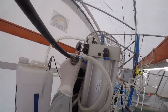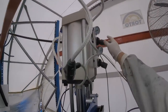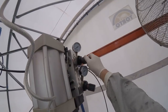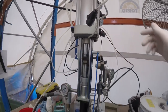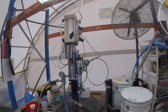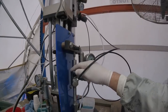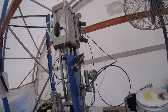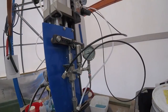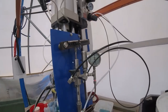So here we are at my gel coat machine. I've just attached the air source, I've turned the air on. I then turn my attention to the machine pressure, which I just turn up to a small pressure that enables the pump to recycle the resin up through that silver hose into the pump and then back down into the blue hose, which ensures that I don't get any air bubbles, and I reflux that for a few minutes. Then I turn the catalyst pump on, where you'll notice the pressure gauge increasing, ensuring once again that there's no air bubbles in that catalyst.